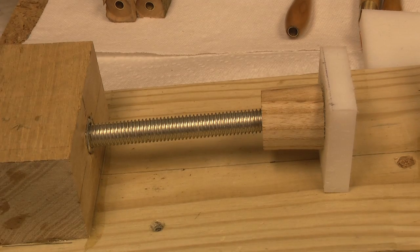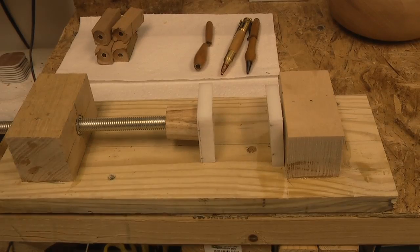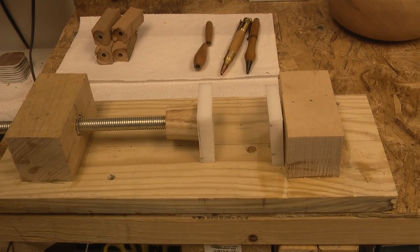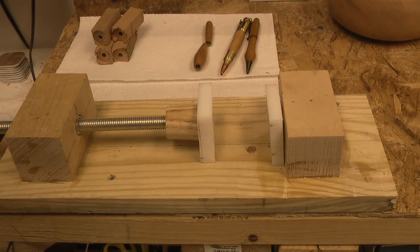If you try to do it without some type of press piece at the end, it's not going to work. I also cut another piece of HDPE to use as the ends to press the pin kit into. I tried using wood instead of HDPE and it worked, but I didn't like the results. Since I had HDPE lying around I used it and I'm much happier. PVC or some metal would probably work too. I have two pins turned in preparation for this video — let's go ahead and press them together, then I'll show you how to use it as a pin maker's vise at the drill press.